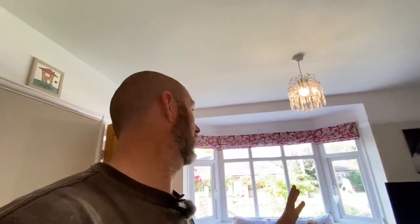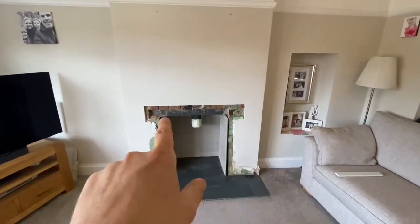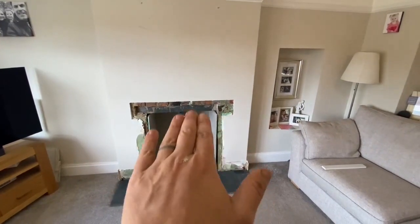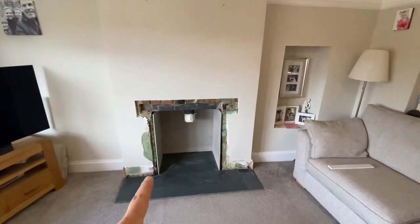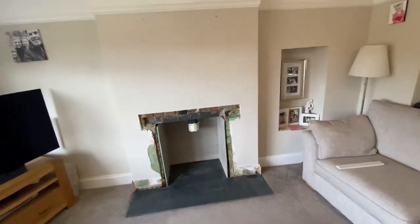And unfortunately, we're waiting for the stove company to fit the stove, because they're going to sign it off. I've got to wait and see what they're going to say about the timber lintel, because I'm worried if I put the timber lintel in, he won't get his registry plate in. And I need to put the timber lintel in before I plaster. And then I need to put the skirting board on. And I was hoping I was going to be able to come back here tomorrow afternoon or maybe Friday to do that. But until I hear back from the company, I don't know.